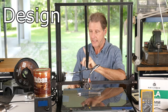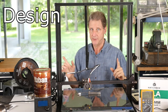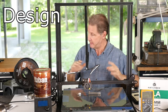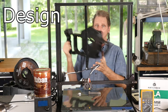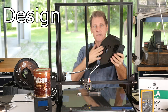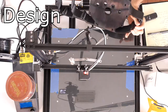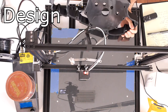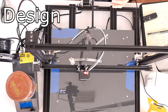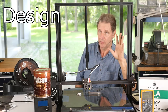I'm pretty sure when it runs out of filament it turns off the heaters - which is tragic. First, you want the heat on to pull the old filament out. For me it's really tragic because I use plain glass with no glue. When the bed heat goes off, the part just picks right up off the glass. Look at that surface finish on the bottom - it's like glass. So that was an issue - I wish they'd improve those things.